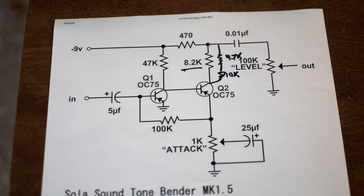If you go to the opposite end — the high end of the 10K pot — then you have about 15K of resistance, which is going to increase the bias voltage and kind of overload the transistors a little bit. It's just a nice sweep and a nice amount of resistance, and it really allows you to dial things in. If you ever have temperature variations or if the fuzz isn't quite sounding right, having a bias pot of 10K in series with that 4.7K resistor is really helpful. Alternatively you could also do a 20K pot all by itself — you'd have even more of a potential sweep of voltage all the way down to zero. But a 20K pot is a little bit more difficult to find that optimal 4.5V range in the middle, since you have more travel and are covering more ground. So the 4.7K + 10K method is my favorite.